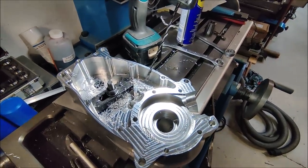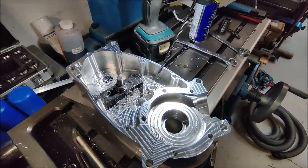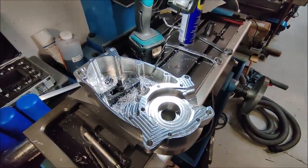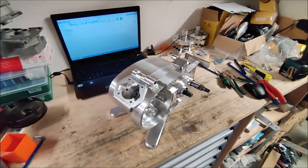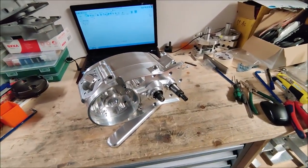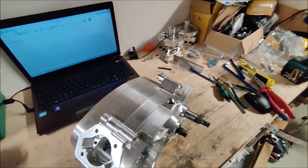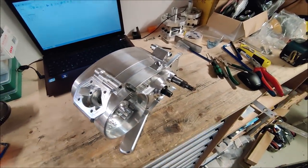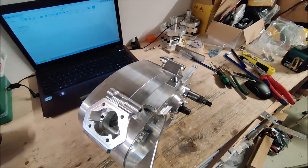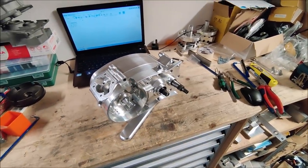Next up, make a bronze bushing for the other cutter half, and some small steel shaft pins that need to be press fit inside. The two halves have now been mounted together with the shafts inside. Everything lined up properly. There is enough play in the shafts in this direction, which can be shimmed out. I had some troubles with the previous engine, that it was too tight, and I had to remachine some bearing surfaces. So lessons learned, this time it fitted better.